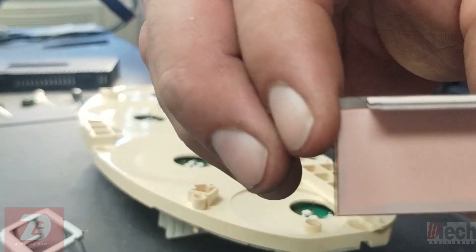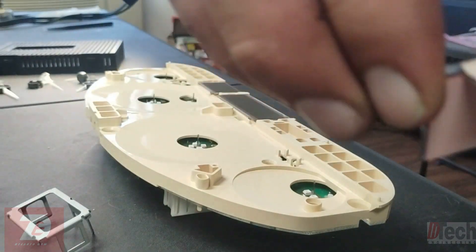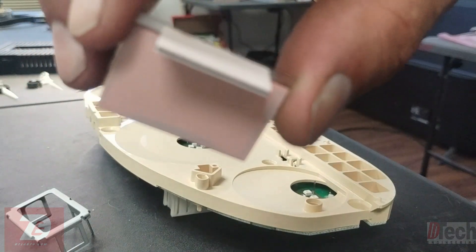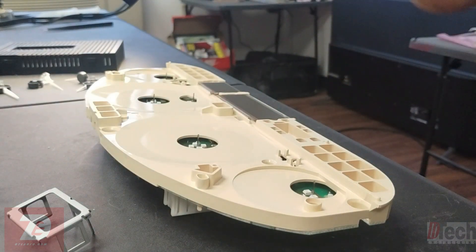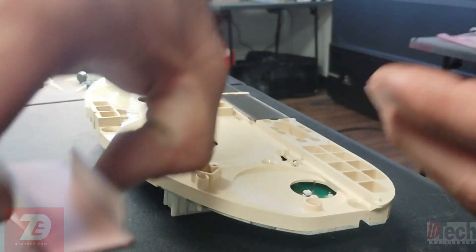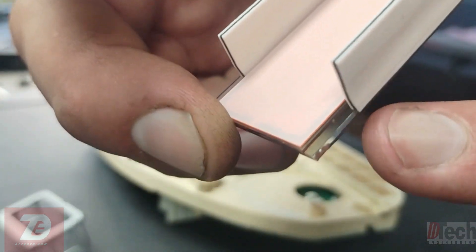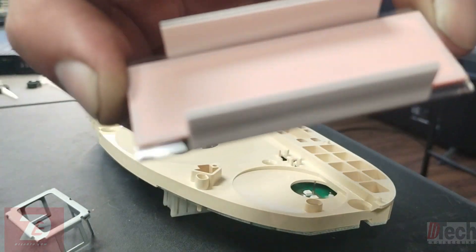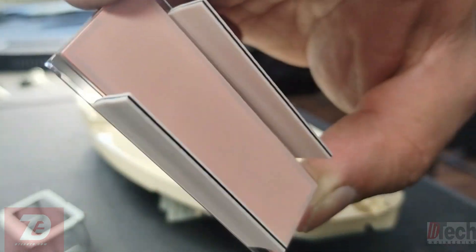It's all about light travel. These pads here are soft like foam, but there are kind of like channels in there — I refer to them almost like tiger stripes. Each tiger stripe is a traveling light channel that you can't see on camera; it's in that black portion and also in the glass. If these pads come off you'll have to line them up, so try to make sure these pads stay on the glass because they are all lined up with the correct stripes.